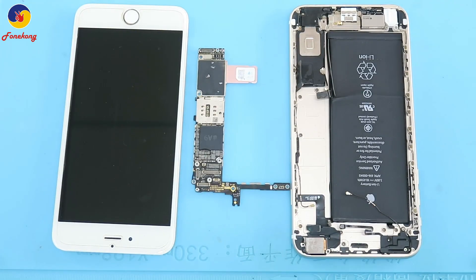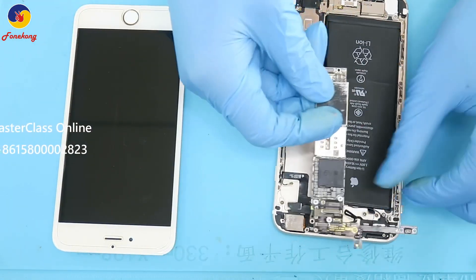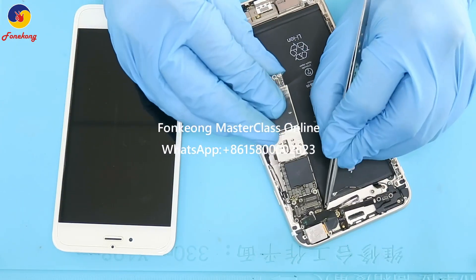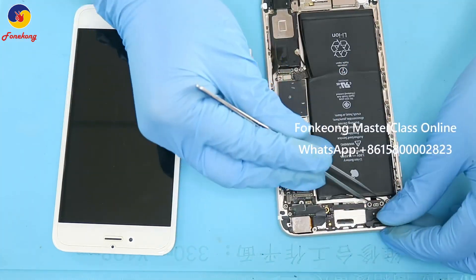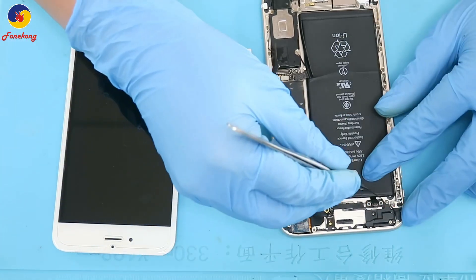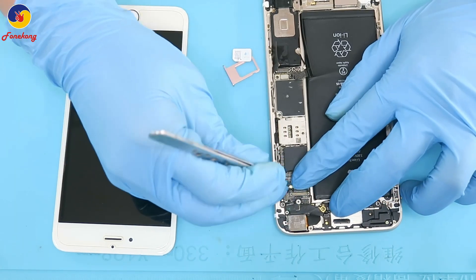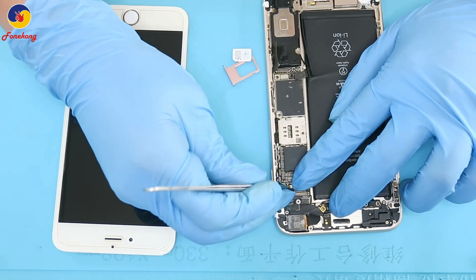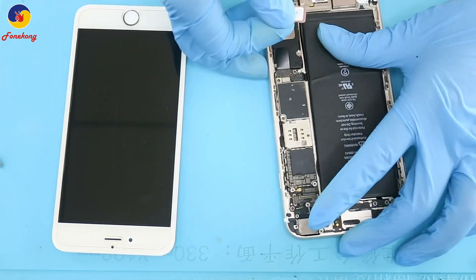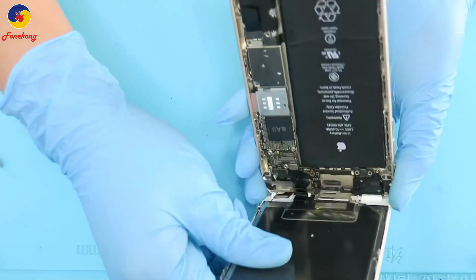Okay, let's try. Re-balling finish, and then let's test the ball. Install the motherboard back to housing. Connect the cables. Put the SIM card inside. Connect the LCD. Ready?